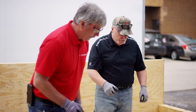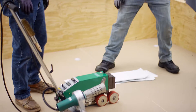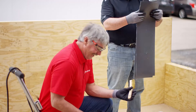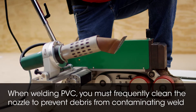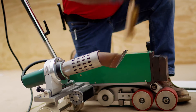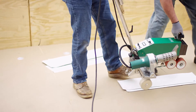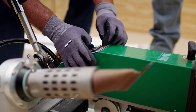Never reach on the side of the gun to lift the membrane. Always lift your sample, set it, and let it cool. We're going to bump up to 800 degrees now. When welding PVC versus TPO, you're going to get a buildup of char or soot. If I'm welding a 100-foot seam, odds are I'm going to have to clean the nozzle every seam — same with hand welding. Always have a wire brush with you, and make sure your nozzle is not pinched closed; all those holes are there for a reason.